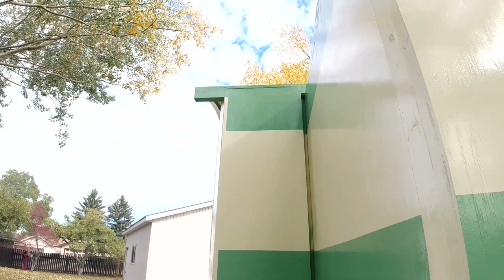At the very top of the house, you can see the fiberglass coming down at some point. We did not prime that, we just scuffed it up to accept the paint. During our testing, we found that the fiberglass did not soak in any paint, obviously, because it's not porous. Why it's so good against water.